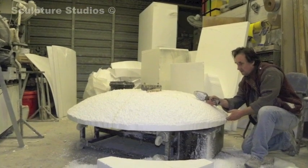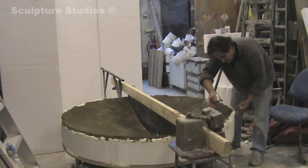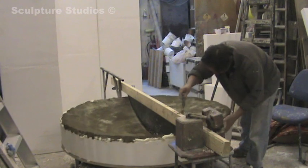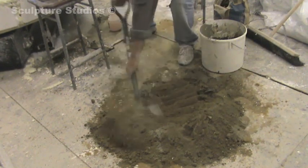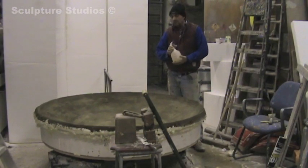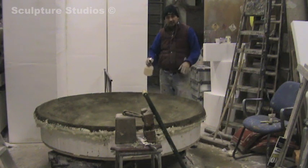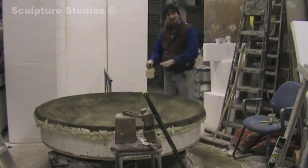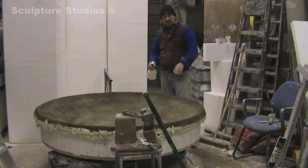Not all aspects of the project go exactly as smooth as you plan, and here I am just trying to create a disc — I wanted this beautiful tooled effect. I'm working into the early hours of the morning; this is a Friday night and I want to get this pattern and mould done by Monday. My machine broke down so I couldn't turn an actual pattern as accurately as I wanted, so I decided to create a female mould so I can lay in the fibreglass afterwards and cut out a process.